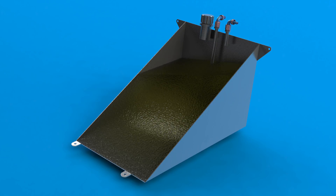First, looking at the problem of storing a large volume of liquid on board a racing car. As you might expect, the loads that the car is subjected to have the tendency to throw the fuel around within the tank. If left uncontrolled, this sloshing can cause problems such as stressing the walls of the tank, causing fuel surges and unbalancing the car.